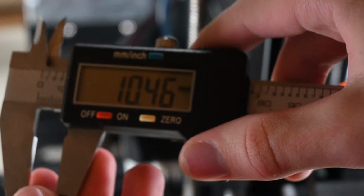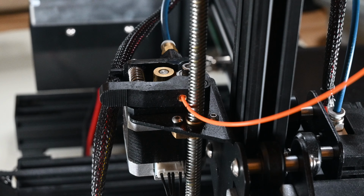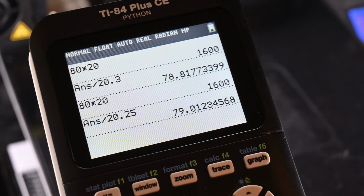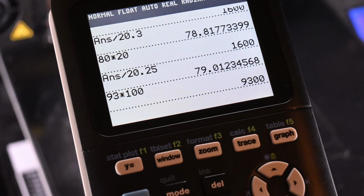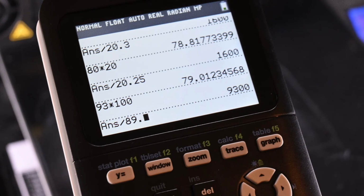If the 100mm mark does not go into the extruder, however, you can subtract the length between the 100mm mark and the new extruder assembly entry mark from the desired 100mm. And lastly, if your 100mm mark is right where the filament enters the extruder assembly, it's extruding perfectly. In my case, the printer was under extruding, and it missed about 10.5mm of filament, meaning it only extruded 89.5mm.